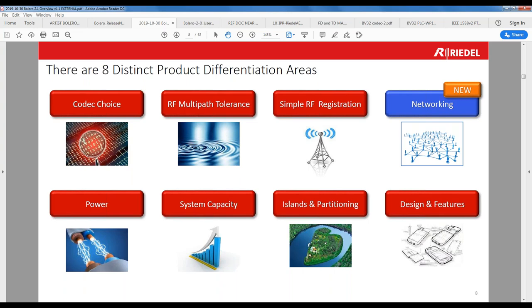And the first thing that's going to happen in any environment is your RF is going to be bouncing around. When it bounces around, it comes to the receiving device at different times. In a primary transmission with no reflection or no multipath, it comes straight to the device. So it comes how it was meant to come. It's going to be vertically polarized. It's going to get there first. Multipath is going to result from reflections, and signals are going to get there after the fact. They're going to get there later, and they're going to be off pole. What we mean by off pole is they're going to reflect and refract off of objects in the immediate vicinity, and they're going to come, let's say, off axis.